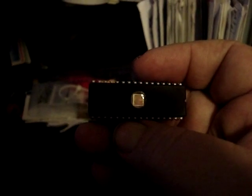All we have to do now is take the chip out. We need to put a label over top of this window, because even though it probably won't be a problem, direct sunlight can eventually erase the chip. So we'll go ahead and put a label on it and label it with the name of the program, the version number, and the date.